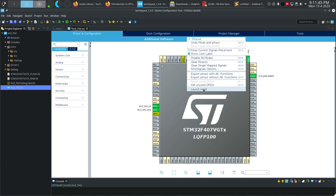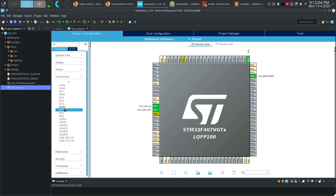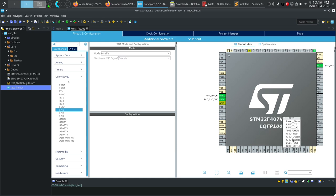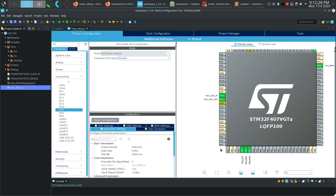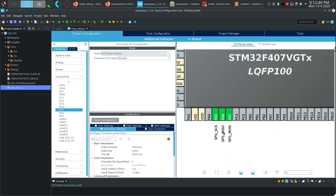Reset for a clear pinout. To initiate SPI you need to know which pins support it. In CubeMX, go to Connectivity, click on SPI1, and expand it — this is much easier than going pin by pin. Enable full duplex master for transmitting and receiving at the same time. As you can see, it has also configured the GPIO for the green pins: the SPI clock, MISO, and MOSI are all initialized.